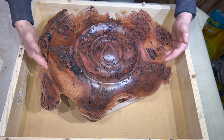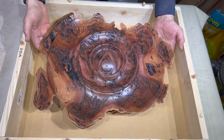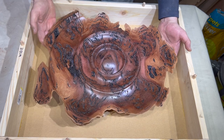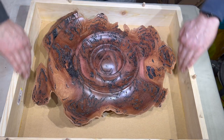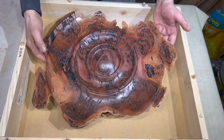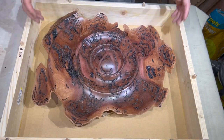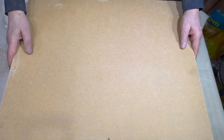Next time you'll see it - I've just fixed that bit, rubbed it right back to 80 grit through the grits to 2000 as I have done the whole thing, re-waxed this section. I knocked together a little box with a note at the end saying 'wide' - the bit with more material on that side goes in there, it stops in the middle. A little bit of movement in there but nothing that can hit the sides, so it should travel well. I'm going to put a little bit of padding on the sides for protection, and a little bit on the lid. Now it can go off to Lenore for gilding.